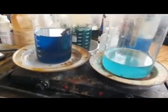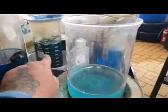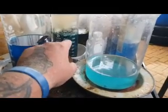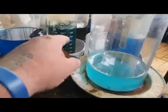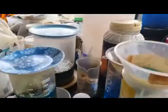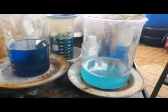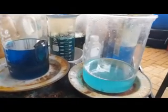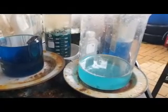The amount of boards that I've done in this video would probably match up to the amount of boards that I would process in this, but this has also had pins in there and plugs and all kinds of stuff. It doesn't matter about the plastic, it doesn't matter about the cardboard or the boards or any of that rubbish, because that all gets filtered out. Even though it's in the solution and even though it's in the AR, it doesn't matter, because when the AR is treated and all the gold's dissolved, I filter it and I squirt off all the boards and plastic and plugs and whatever else is in there to get the gold solution out and get the gold filtered into a nice container, nice and clear.